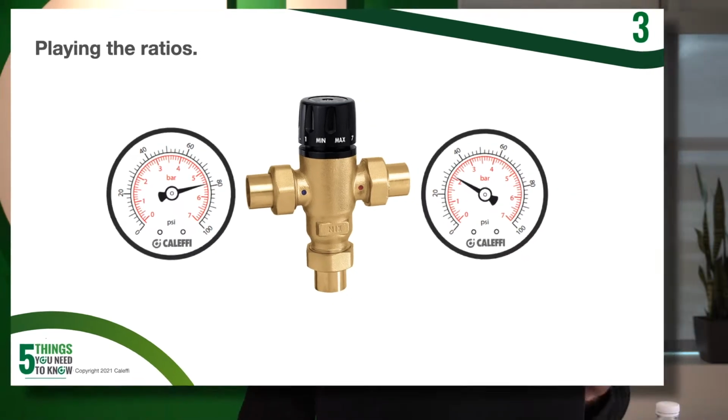Now, particular cases where this happens, and it doesn't happen very often, but it's typically where you have too great of a pressure drop across your hot water source. And where you're typically going to run into this is going to be your tankless water heaters and your tankless coils and boilers that you're going to typically see in the Northeast region.